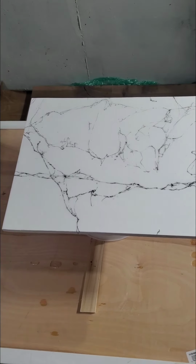So right to it. I'm just going to take a piece of sandpaper here. This is 220 grit. And all you want to do is just lightly buff over your area here. Take out any imperfections you might have. If you had a bubble or something come up in the seal coat, this is where all that needs to come out. And then on top of this benefit of laying down the graphics and getting everything nice and smooth, it's going to adhere that flood coat real well.